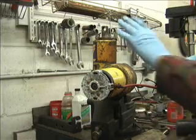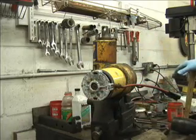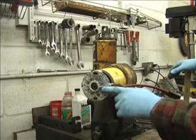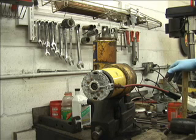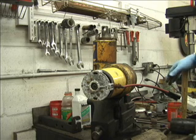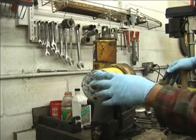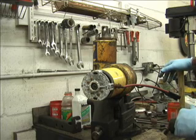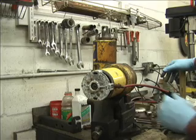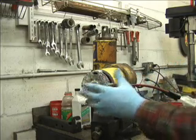Excuse me. The next generation of this motor, and as you can see the screws are out of it, it's just staying right where it is. The next generation of this motor that uses the two lugs is manufactured by Iskra, I-S-K-R-A, and they're made in Slovenia. The third generation of this larger motor, currently in use by Meyer, is made by Prestolite, just like they used to be back in the 70s for the E47 units. And Prestolite is manufacturing them, I believe, in Oklahoma, USA.